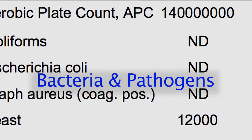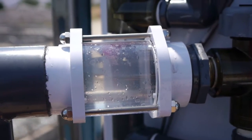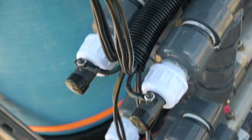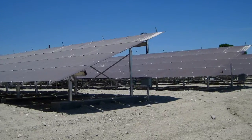As an added bonus, because the ORP levels in the electrode tubes get to be so high, pathogens just cannot live in that environment, and the water is almost completely disinfected by the time it returns to the culture tank. Everything in this design is rigged for very low power requirement — you can literally power this by solar panels, and not a million solar panels, but just ten solar panels.